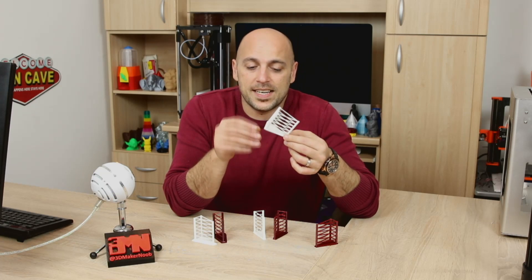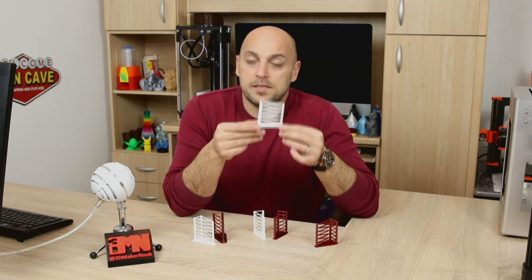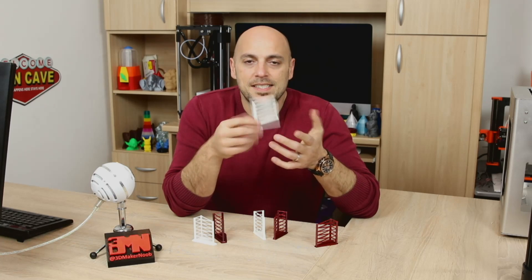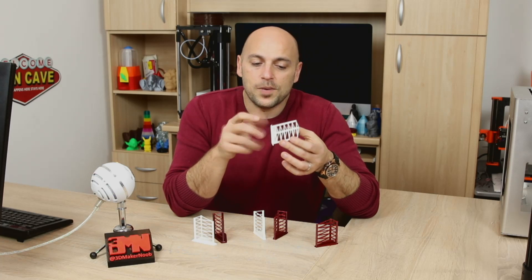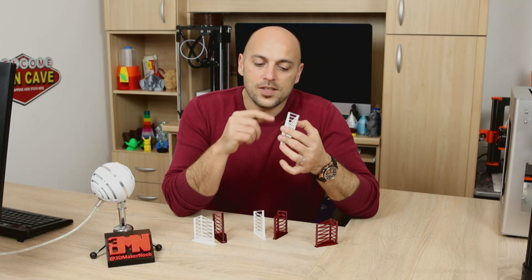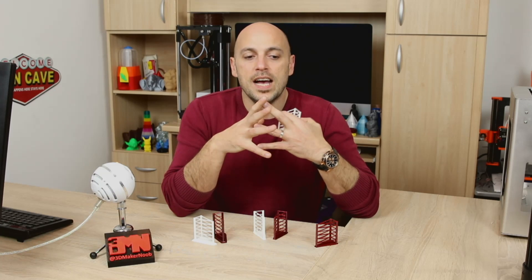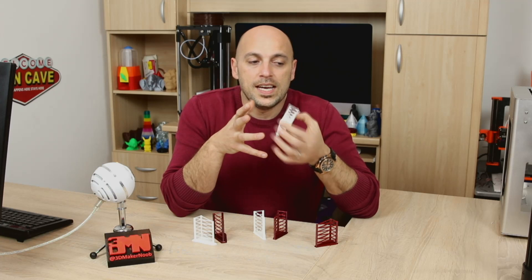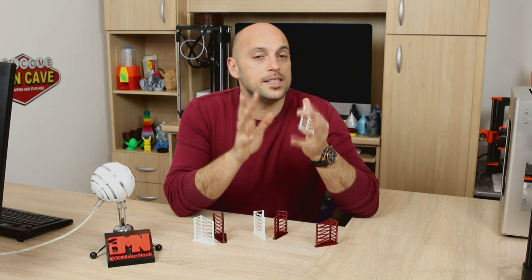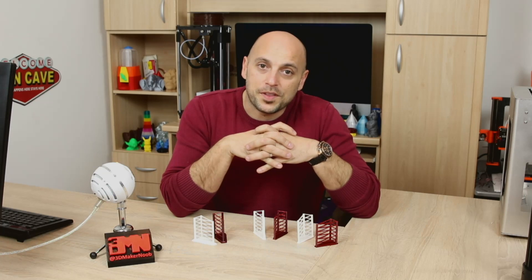It is very simple in design. I did this within about five minutes in Tinkercad — a triangle base at the bottom, three columns and some bridging. I did this in six different sections. The reason why I did six different sections is because I wanted Simplify3D to tackle each section with different filament retraction settings, so I wouldn't have to ruin a whole print if that particular print is very smooth at the bottom but then has a lot of open spaces at the top. This helped out quite a lot and I figured I'd share my experience with you guys.